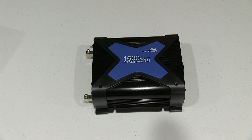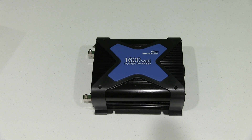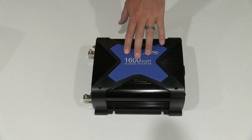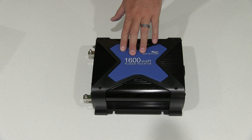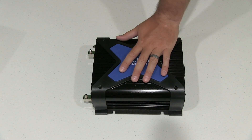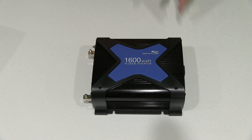If you're planning to use something like this, it would probably be in your best interest to use something like a Kill-a-Watt — you can find that in the video description link as well. What it'll enable you to do is measure the watts of your various components, and measure it while they're powering on and powering off. Because typically when you turn on a computer or a TV, it's going to be a surge as it starts and then balance out. Make sure you're not plugging in a device that would exceed the capacity of this particular power inverter, since it comes in different sizes. Thanks for watching, and be sure to subscribe if you haven't already. YouTube.com forward slash iRixGa. Y'all have a good day.